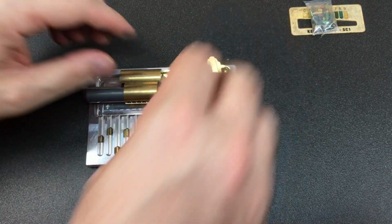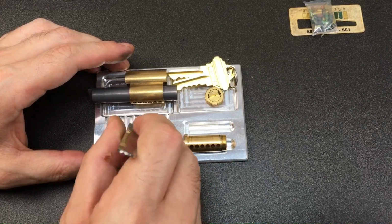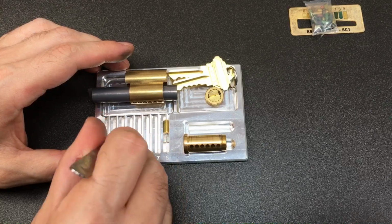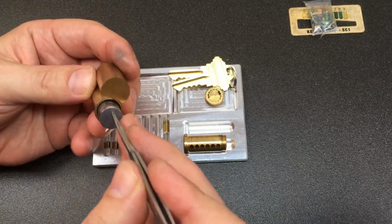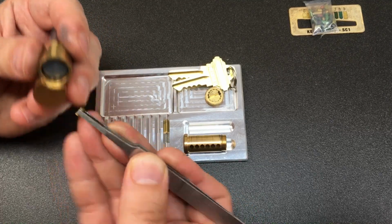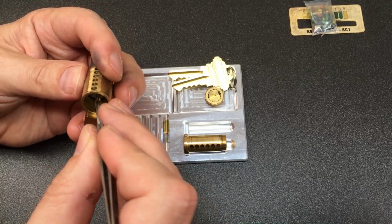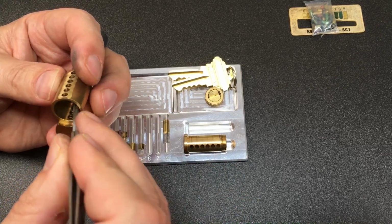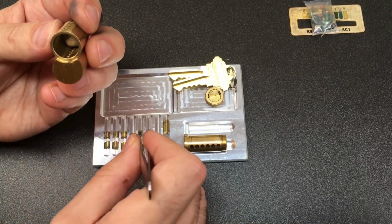Interesting stuff. Okay, right, now for the bit that I think we're all interested in, which is, let's put those key pins right. What are the driver pins in this? What is this big mystery here? There we go. And I reckon it's no mystery at all. It's all standards. So let's have a look. Oh, no way. Actual serrated spool. Standard. Serrated spool, not very big serrations, not like an American lock, but still. Serrated spool. They're too shallow, I think.